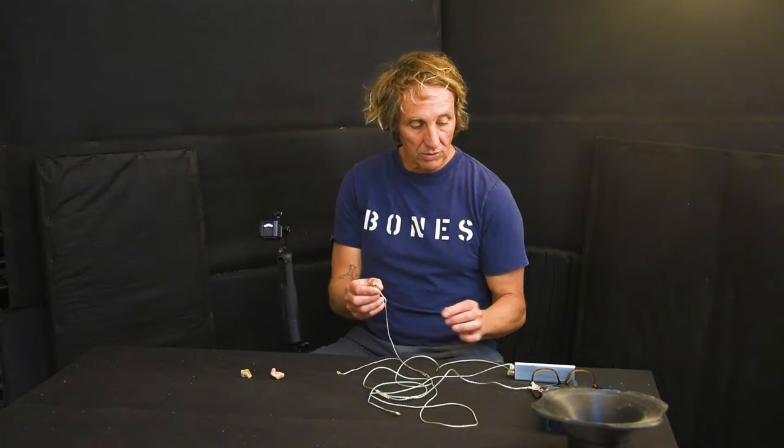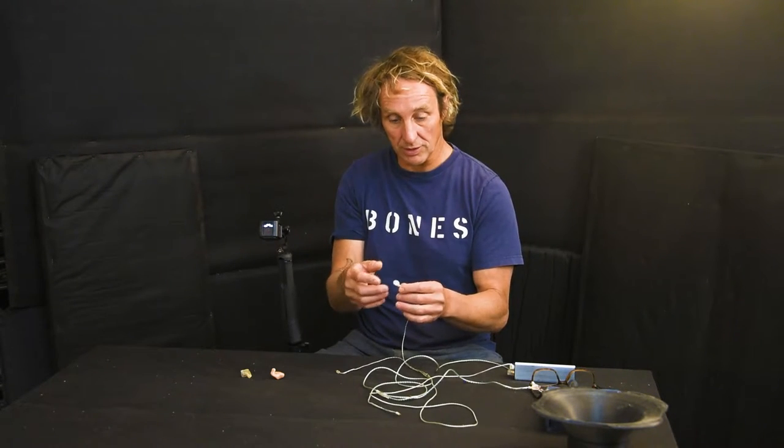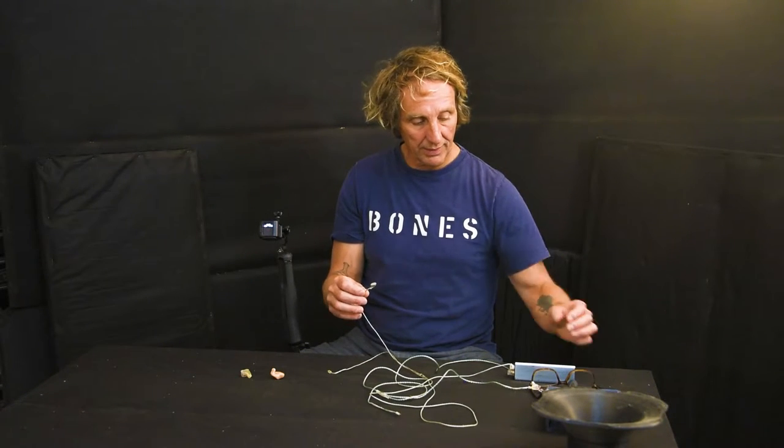Now, what happens with a normal speaker is, since there's a diaphragm and there's an opening in front and an opening behind, we would normally put that in an enclosure and port the enclosure or tune it. We have to do something with the sound that comes off the back of a speaker, because if you let the sound from the front and back combine, they're out of polarity with each other and they will cancel out, and you won't have any low end. You're losing a high percentage of your energy in cancellation. And I can demonstrate this fairly easily by hitting play.